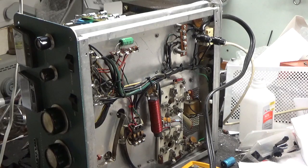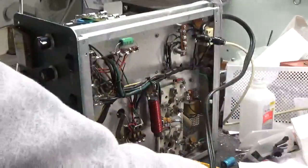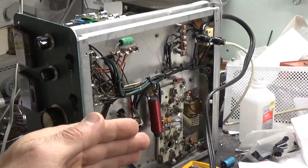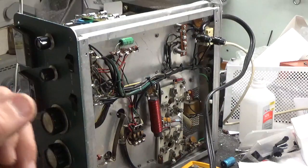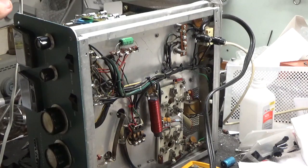And I got the amplifier, took it apart. I noticed that a whole bunch of components on the metering board were just obliterated, and then noticed that on the top RF deck cover it was missing the piece that pushes down on the crowbar circuit, because these amplifiers come factory with a high voltage crowbar circuit which puts a dead short in the plate supply if the RF deck cover's off. So because that piece was missing, he had a dead short in his plate supply and blew up all those components. Luckily the meter seemed to be okay.